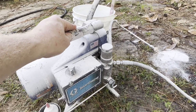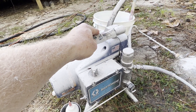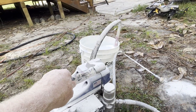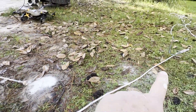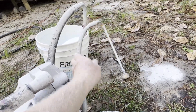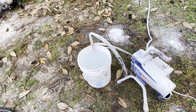I've sprayed. The system has paint in it. We have to get the paint out. So we're going to begin by drawing in clean water and clearing out the hose and the machine. I have clear water in here. I'm going to take clear water in and start clearing out the machine.